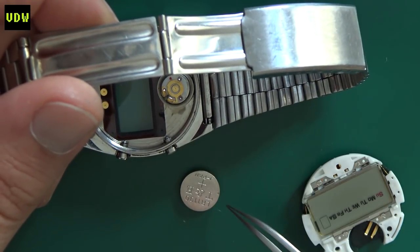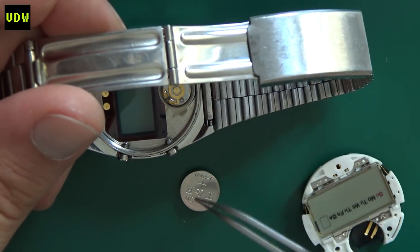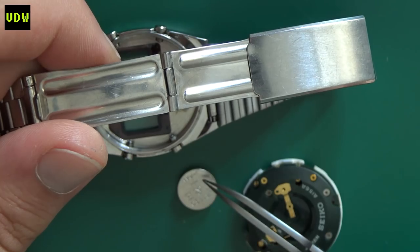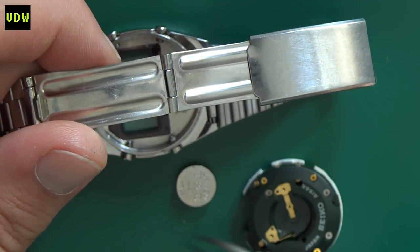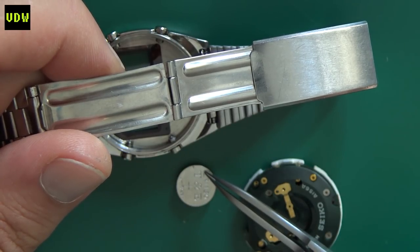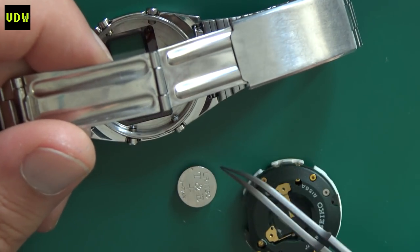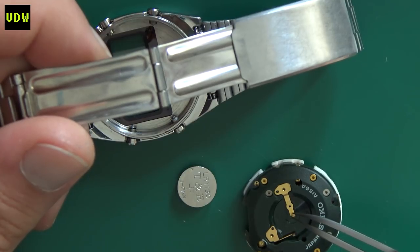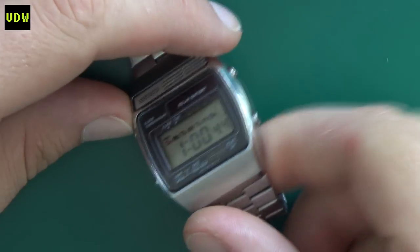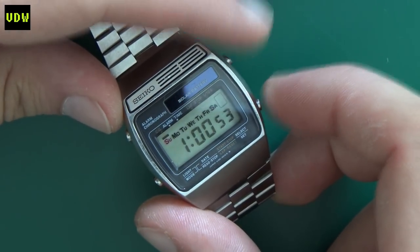The Panasonic MT920, a modern-day power cell used in other watches, is not this size so it won't fit the battery recess correctly unless you modify it. Some people put conductive material - like copper tubing - around smaller batteries to increase their size. You cut a piece of copper tubing tall enough to cover the entire battery, slip it over, effectively increasing the battery's diameter so it fits a larger recess. This watch also has a micro light activated by the top-left corner button. To activate and deactivate the alarm, you just hold the two buttons on the right.